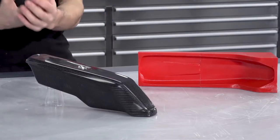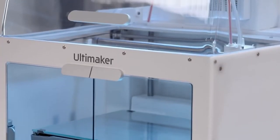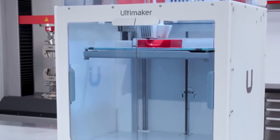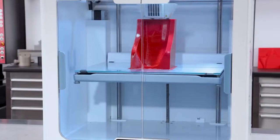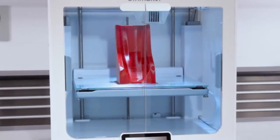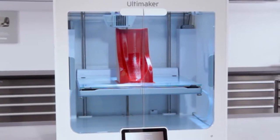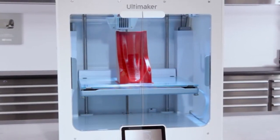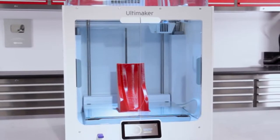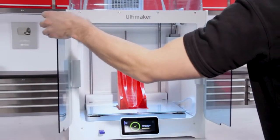The part we're making today is a battery box for an electric bike, and I'm going to start off by 3D printing the mould. I'm printing this on our Ultimaker printer at a 0.15mm layer height using the standard settings from Cura. I've done quite a lot of testing with different filament materials for mould production, and so far found that PETG offers the best balance of resin release performance and ease of printing. One material I would not recommend is ABS, as epoxy resin will readily bond to it, making release of the part difficult. Our printer supplier Dynamism have put together a page on this subject — I'll include a link in the description.